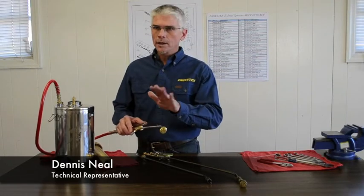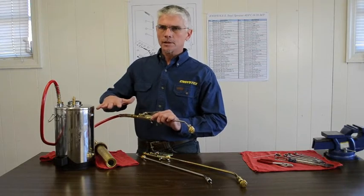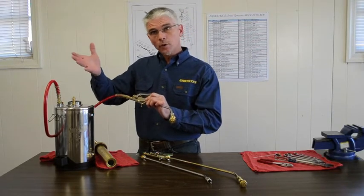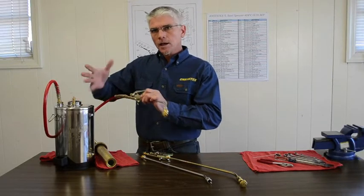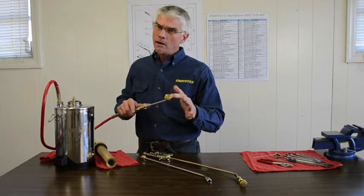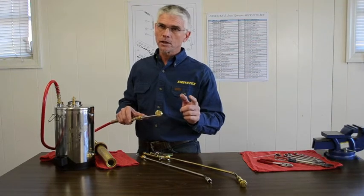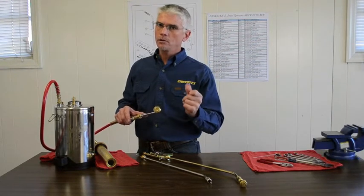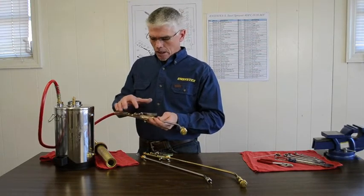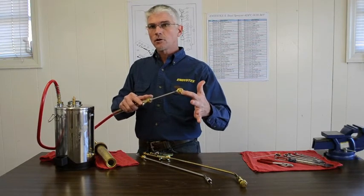Joe, let me explain that, but first by explaining the mechanical thing that's taking place. All we're doing with a compressed air sprayer is compressing air in a tank and forcing chemical out before we get to the air. And in order to do that in a pest control environment, and do it safely, we need to be able to cut the flow of chemical as soon as a trigger mechanism is released. That's going to be challenging to do if your valve is back here and your discharge end is here.